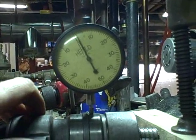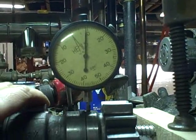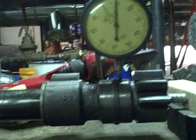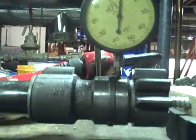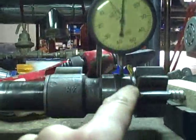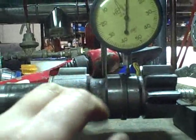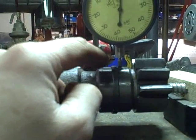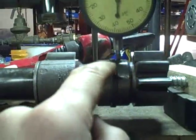That was the high point I just moved past. If I go up right there — nine thousandths. That indicates that the shaft is bent this way right now, even though with the naked eye I really can't see it. So it's nine thousandths on that journal, and now I'm going to switch the jig over to this journal to see if it's worse, because I would suspect that it would change on this side.